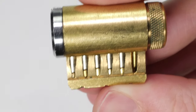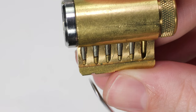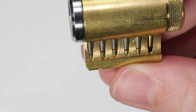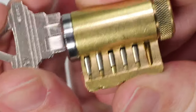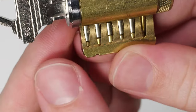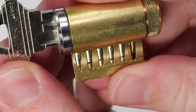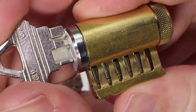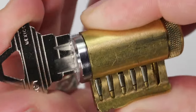Regardless of that, the problem is that nothing is going to be pushing these driver pins up. Without all of these key pins sitting in the plug and the driver pin sitting way down, it's going to make it so that we're not actually going to be able to have the key operate this lock — and this lock is going to be completely non-functional. This is something I've run into several times when working on locks oriented in the pins-down position. If you have springs that are shot and not working well, it's very important to fix that because you do not want your lock to just stop working.